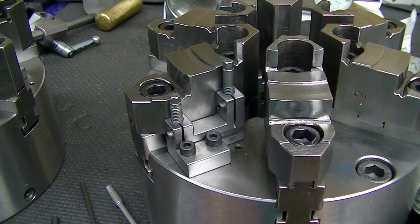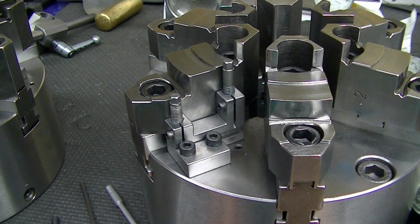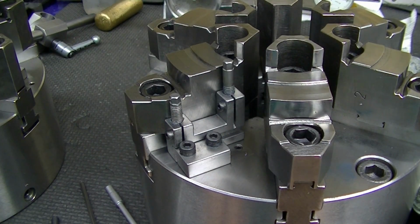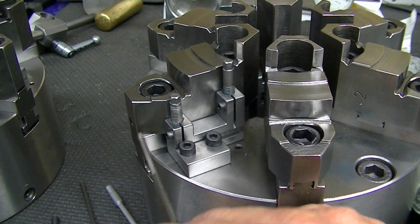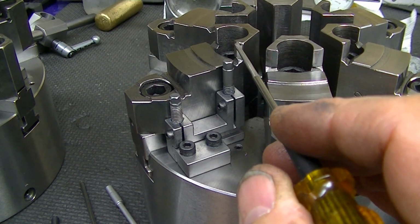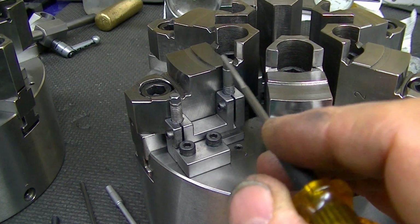This is the chuck system for things that are past the range of the collet discs that I just showed you previously. So these need to be for both my regular jaw chuck shown here, and my reverse jaw chuck, which I'll also show. So design-wise, look at this and say, okay, what's typically going to go in here? It's not just external gripping that you'll use these stops for. Sometimes it's going to be internal gripping, how we have it shown here.